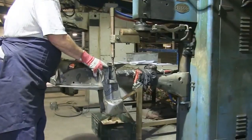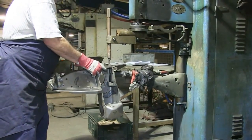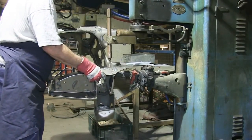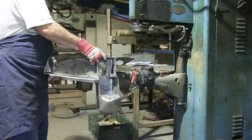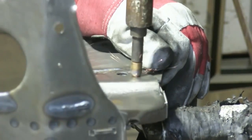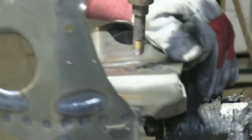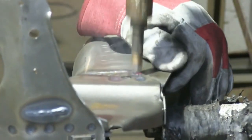As well as MIG welding, parts of the subframe are also spot welded together to complete its strength and rigidity. This is an important part of the structure, and exact compliance to the original drawings in the number of spot welds and the MIG welds is considered crucial in the production of a strong subframe. These spot welding machines are the biggest in use at the Heritage factory, tightly pressing the parts together between their copper tips while passing a current large enough to weld the heavy gauge steel used in subframes.